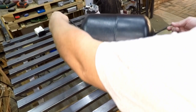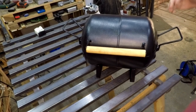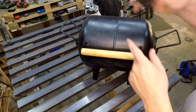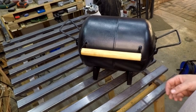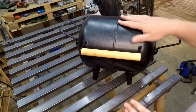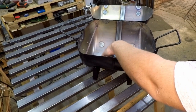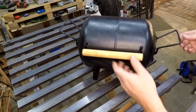I painted the whole thing and added two handles - the ones taken off the canister at the beginning - cut in half and added one on each side so I can carry it around. For the paint effect I used a lightly hammered finish by taking a piece of sponge, dipping it in paint and jabbing it all over for a rougher look rather than a smooth finish. It's heat resistant paint so it shouldn't peel once you make fire in it. I'll consider later making a smaller grill at the bottom to hold the coal so it doesn't burn through the cylinder too quickly, but for now this is exactly what I wanted.